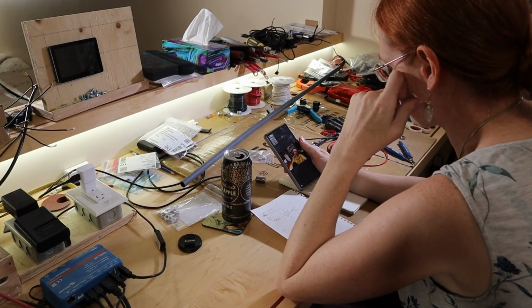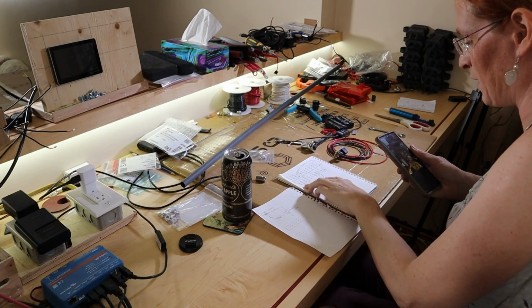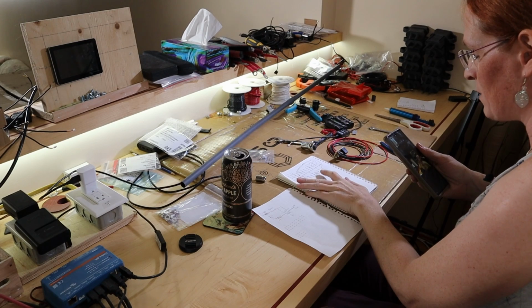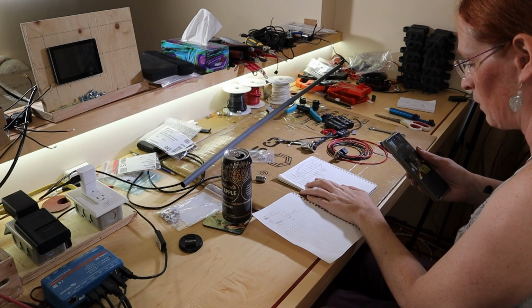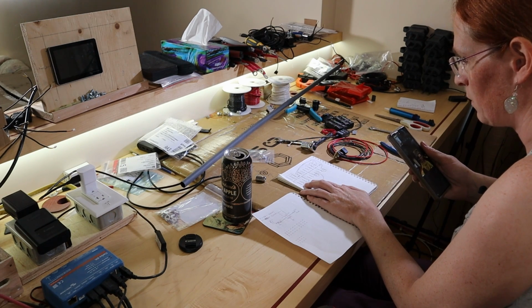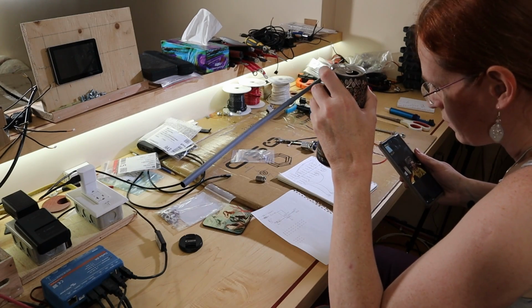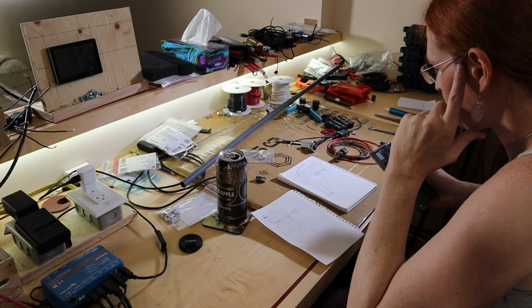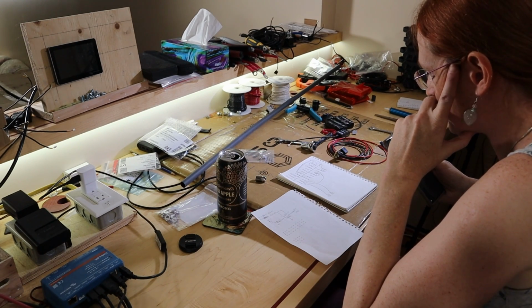That's what that diode's for, right? And because I changed the design, not realizing the implication, I thought so long as the capacitor spanned the positive and the negative of the input, it would do its job. You have to assume when you disconnect large loads like this, there's all kinds of inductance built up in cables and stuff. You're dealing with big currents, right? Yes. If you disconnect something and now it's floating, you've got inductance. It has to go somewhere. Where does it go? It goes into back EMF. It's going to kick back in the negative direction.